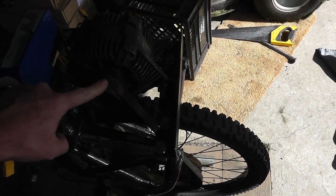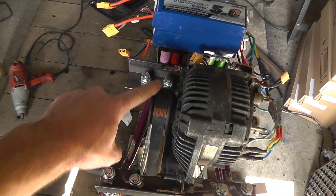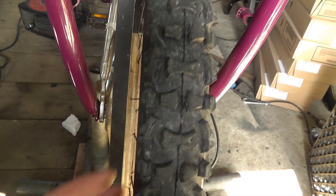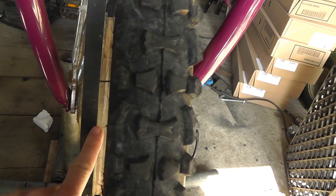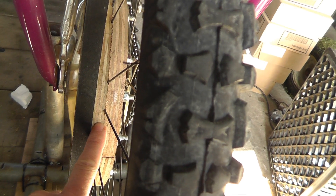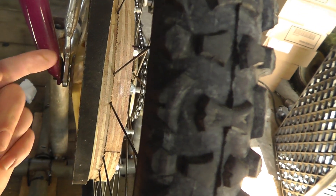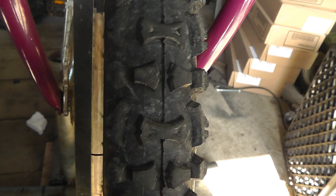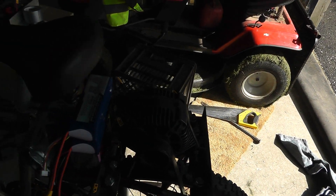The whole thing is driving the back wheel via this pulley and down to this larger pulley, which has been taken off a washing machine. That pulley is held to the wheel hub via these two bits of wood which are sandwiched in the spokes, and then the pulley is bolted to everything so the whole thing is clamped tightly to the hub, which keeps everything nice and strong.